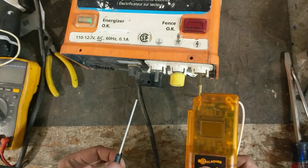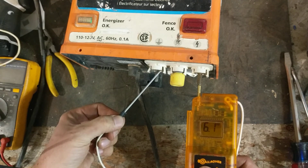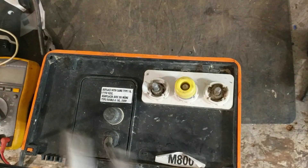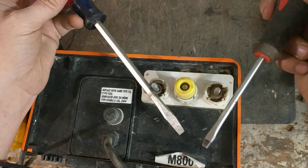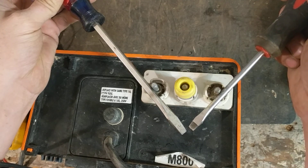This is the ground probe and a little brass tab that lays on your fence. The hot terminal goes to the fence terminal. I'm reading 6.1 — just a little over 6,000 volts — which is right where it should be, about 5,900 to 6,000. If I put a screwdriver across it you can see the spark jump. It's not a huge unit at only 8 stored joules, but it's a good unit — the spark jumps pretty stout.